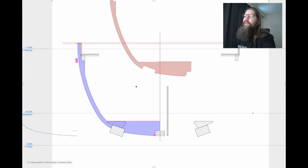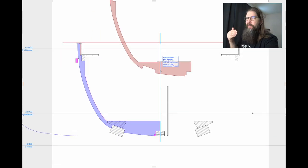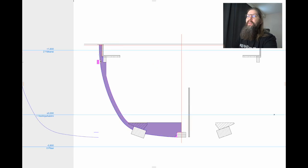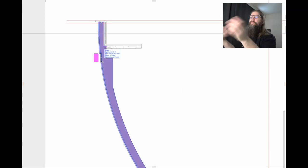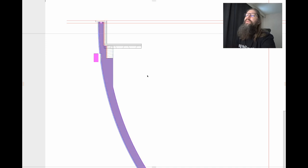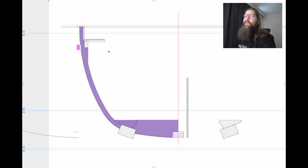And there are two of these from each frame, of course, the forward and the stern. And these are the actual shapes that I use to cut the things with the CNC. For the 3D model, I just make them as 3D pieces and connect them together and get the 3D frames. So that's the process of making these frames.